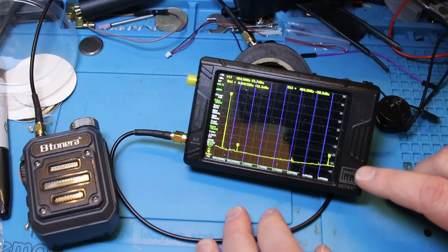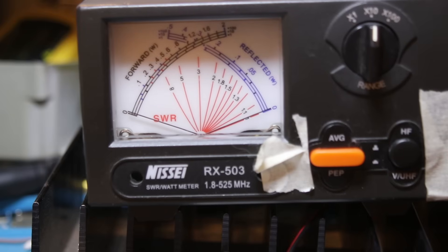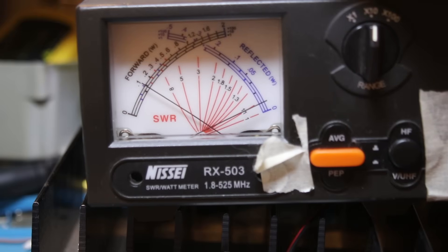I'm going to get a power meter, hook that up, and see how much power we get out of this. We have the radio hooked up to the power meter, and I'm actually going to be surprised if we get 5 watts out of this little thing. Channel 1 is my AllStar node on low power, and channel 2 is high power. High power is exactly 1 watt, and low power is also 1 watt. Now let's see if it actually works — I'm hooked up to the AllStar parrot node.